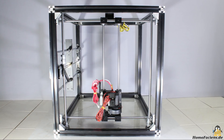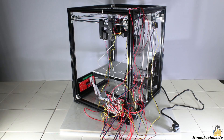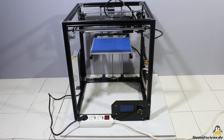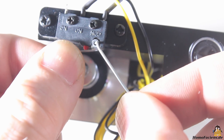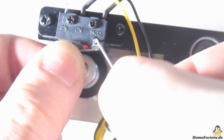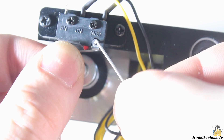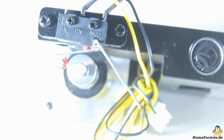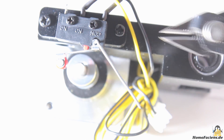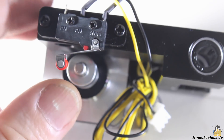I could assemble the mechanics without much trouble, and you can get photos of my build process on my pages. The accuracy of the parts isn't bad; however there was an issue with the X-end switch. That switch was broken because the relatively heavy component it is mounted on caused damage during shipping. The plastic hinge of the metal flap was broken, but I could fix that quickly with a piece of hot wire.